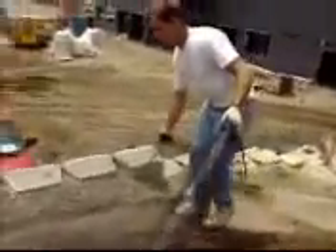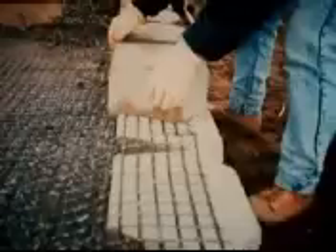Reinforcement is a crucial element of building a stable, long-lasting retaining wall. Your wall construction plan will tell you which courses will need reinforcement and how much to use. Clean any debris off the top layer of blocks. Measure and cut the reinforcement to the design length in the plans. The reinforcement has a design strength direction which must be laid perpendicular to the wall. Place the front edge of the material on the top course, 2 inches from the face of the block.